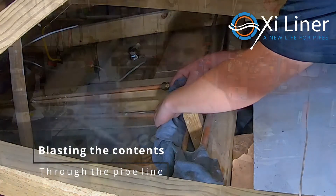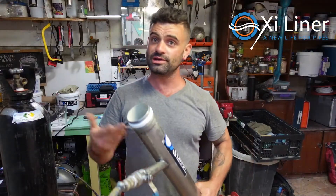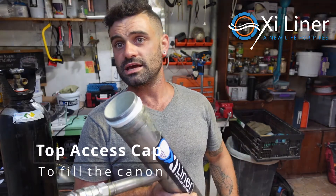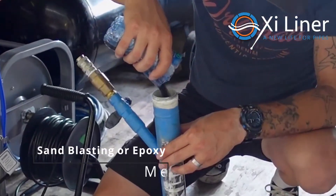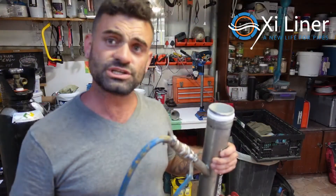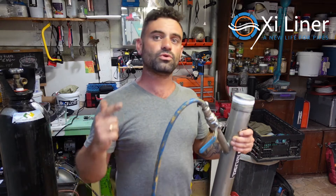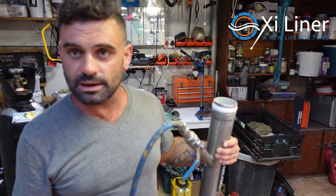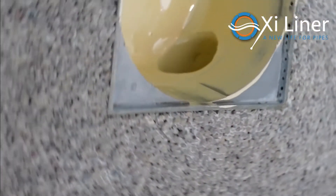At the top end we have your loading zone for the air connection — an open cavity where you can load your sandblast sand. Then you top this up with Oxyliner epoxy, which comes in potable epoxy or non-potable epoxy. The potable will be used for water pipes and the non-potable for drain pipes. It's slightly more dense and suitable for larger diameters.